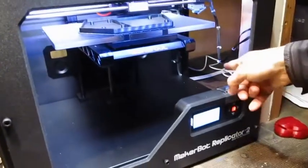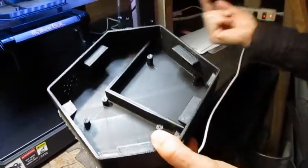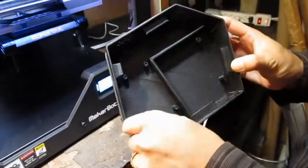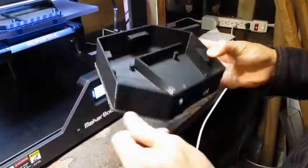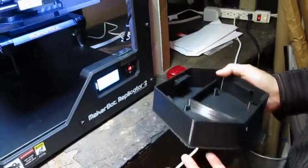We're about ten hours into the repair. This is the repaired x-axis harness, and it's working fantastic. In addition to what we did with the harness, we also tightened up the belt on the x-axis — there are videos on the web for that from MakerBot. And so now we've got great looking prints and no more problems.